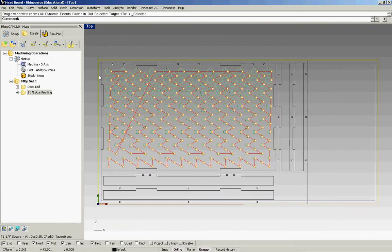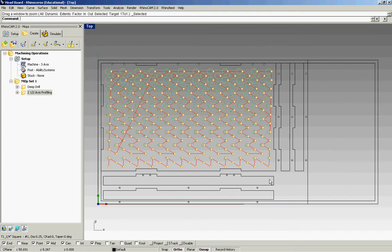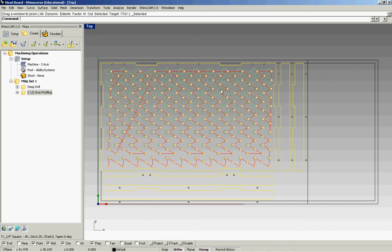And a good practice is just to scan all your pieces to make sure that something weird didn't happen with one of your geometries and it's actually cutting on the wrong side. So I'm going to assume that this is good, so I can move on to my exterior cuts. So for my exterior cuts, I can go ahead and select all my pieces, which I've grouped ahead of time. And then I'm going to select this last line out here, and this line is going to lop off this unused portion of material, so I can use that at a later time.